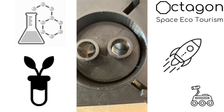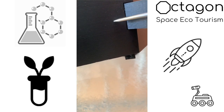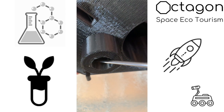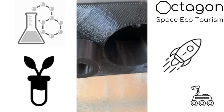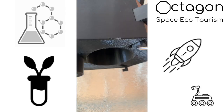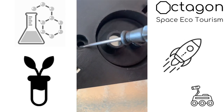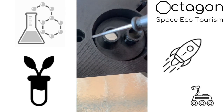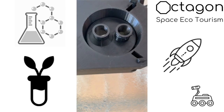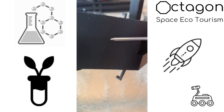Again, the CAD file is going to be the best to show this. But if I slide a piece of paper in here, you're going to see that the top part of this void connects to the bottom part, and there's a layer across here that separates the two. So what ends up happening is that fluid comes in here, comes into the piston wall, comes up around the piston wall on either side, down over here and across the top. It'll come up here, and then come back across and through here. Once again, you can't see it, but in the CAD files the little horizontal component that connects these two is in the exact same shape as this one over here, so that the system doesn't generate any inflow. There's a void equivalent to this that's completely enclosed below the midpoint of this part.